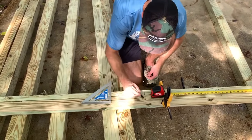We're using bar clamps to hold it in place, and then we're simply gonna do 2 screws through the fascia board into the overhanging roof rafter, the exact same way we did for all of the other roof rafters that we did previously. So again, that's 2 3-inch screws going through the fascia board and into the overhanging roof joist. And then we're gonna go ahead to the other side and put 2 screws in once we had it exactly flush with the outermost fascia board.